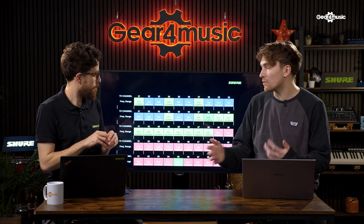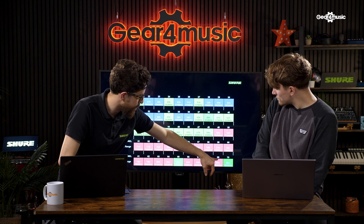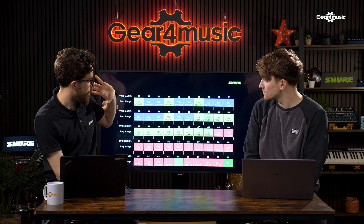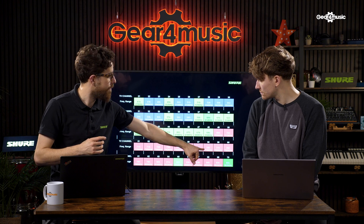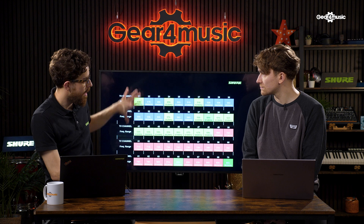Are there any license-free options — systems you can just buy and use out of the box without worrying about a license? There are. There are two license-free parts of the spectrum that we manufacture equipment for. The first lives in the UHF spectrum, right down on the bottom right-hand side: channel 70. It's a very small amount of spectrum — you can only really put four channels in there. Back in history, you could put wireless microphones across all of this spectrum because mobile phones didn't exist. But when the government rolled out 4G mobile phone services in 2012, there was a concern that some users — schools, regional churches, small theatres — would not be able to afford or even understand that they were in spectrum that was about to become illegal. So the compromise was to give a little bit of channel 70 back so those users can live there with a small channel count until they can move into the wider UHF landscape.